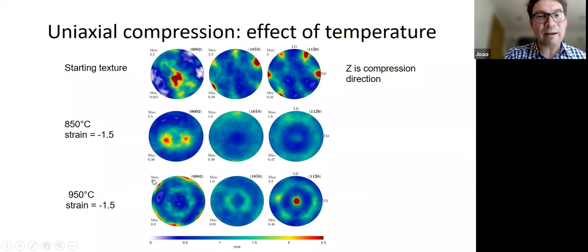And the other thing that you notice is we don't have a fiber. Okay, so now this could be because there's not enough statistics and so on, or there's not enough beta grains, but actually that's a common theme. We often see that there isn't really axisymmetric texture at the end of deformation. And similar here, the split tends to be along a certain direction, okay? And this could be simply because the starting texture is not random, and therefore the deformation is not uniaxial, not axisymmetric, okay? The material sample deforms in different directions.